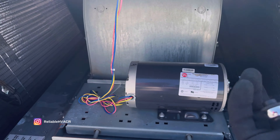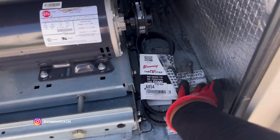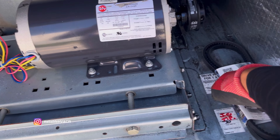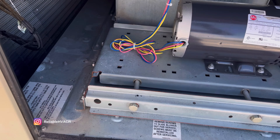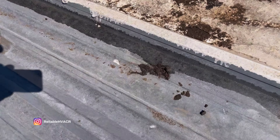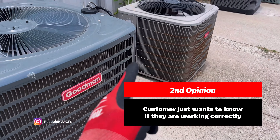These are the crescent wrenches I use exactly for this - to adjust belt tension and blowers. Got all the sizes I need, two crescents and a ratchet for the allen wrenches with bit holders - can do everything we need. I got the extra belt, just brushed out a little debris from where the old one was scraping and rubbing out. Not going to do a full cleaning today but we're going to leave that spare so the next tech can just change it out. Gotta tighten the sides, and we'll start to clear out the drain - a bunch of gunk came out but now it's draining fine. They're going to need maintenance soon.